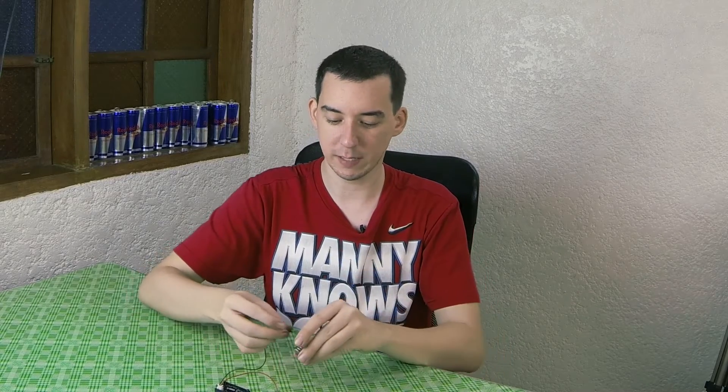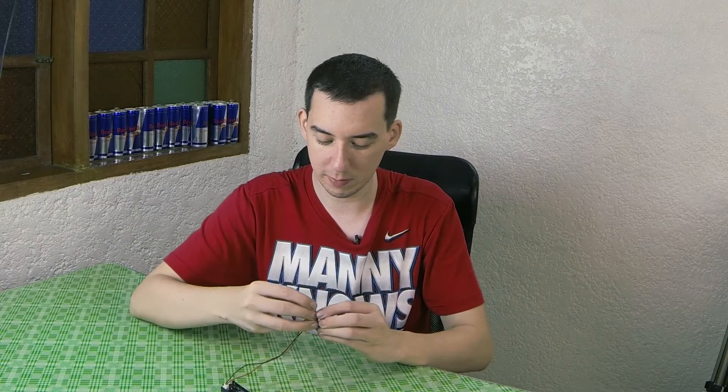As I mentioned, you can measure any DC power source between 4.5 volts and 150 volts. I've got some of these little coin cell batteries — they're rated for apparently 3 volts but I know these aren't full because they've been used for various projects. Let's attach the meter and see what it reads. It's reading 7.3 volts.